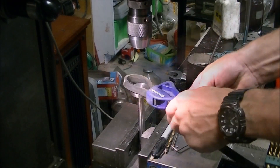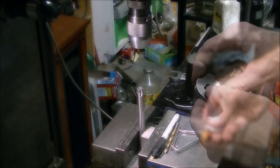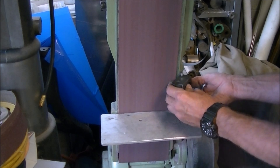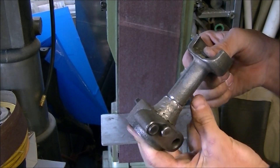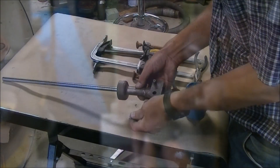Then pulling that top piece off the old shaft — even with the screw drilled out it didn't want to come out without a little help. In order to increase the odds of the brazed repair on the cast iron working, I grooved out the edges of the broken bit to create a little V-groove, to give some room for the braze to sit down in there.